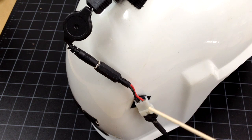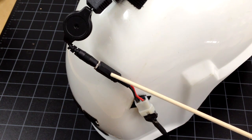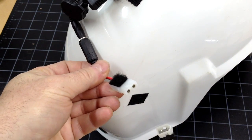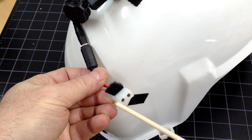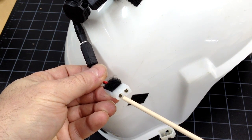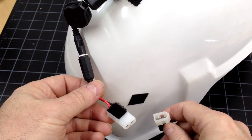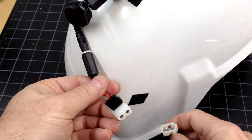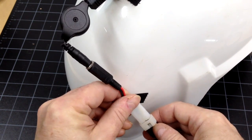Making up the connector is pretty easy: a 1.3mm female connector soldered onto a couple of pieces of wire, then soldered into a quick release. One important thing: whenever you have power coming from a cord, you always want the power feed to be in the female or socket end of a plug, and the power receiver on the male end — much like a wall socket. The wall socket itself is female so you can't accidentally short it out; the male plug, being the power consumer, plugs into the female power provider.